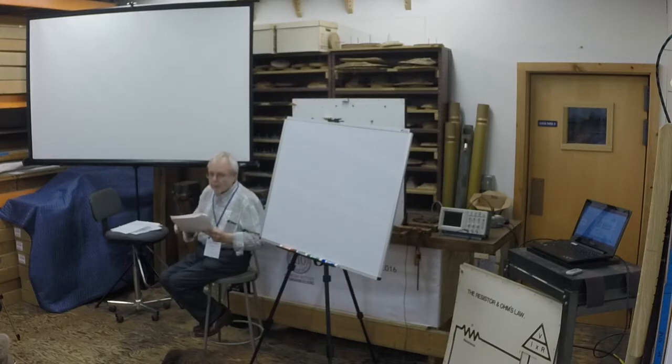These modern power supplies are current limited. This term means that when the maximum current output is reached, the internal controls will prevent the unit from being damaged because it simply lowers the voltage. And when the fault goes away, it's supposed to come back.